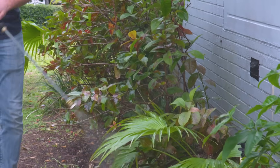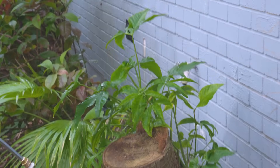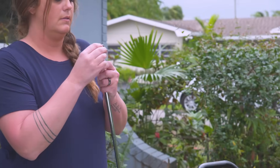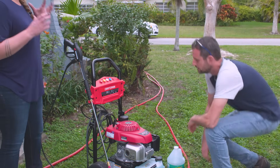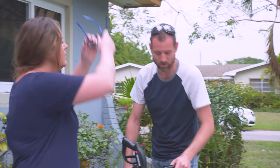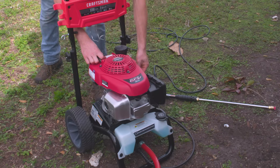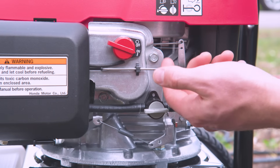To protect the plants, the power washer is turned off so water is just bypassing the engine — low pressure only, because you definitely don't want to do this with the engine on. The first tip we're going to use is the soap tip to start with our cleaner. To start the gas-powered pressure washer: turn the fuel control on, pull the choke out, put the ignition switch to on, give it one pull, wait for it to start sounding like it's choking a little, then push the choke back in and you're good to go. Make sure you put on safety goggles first.